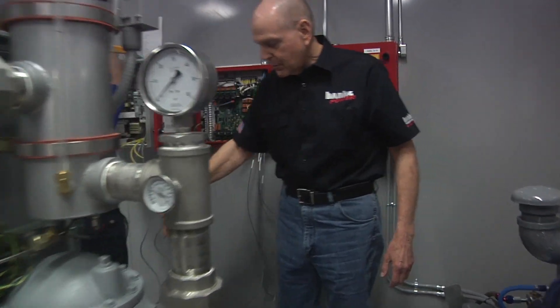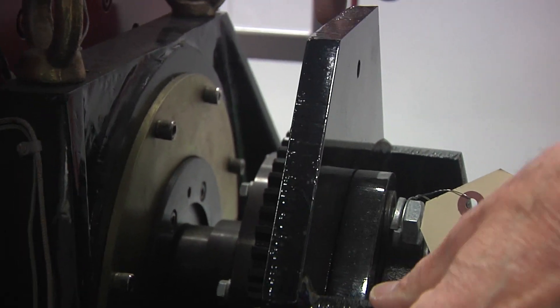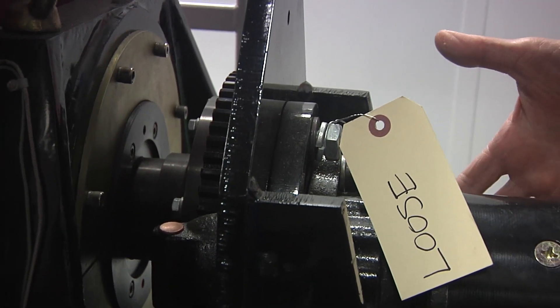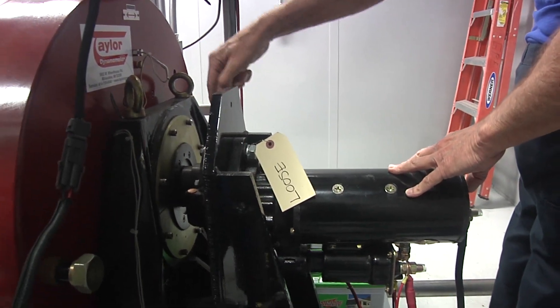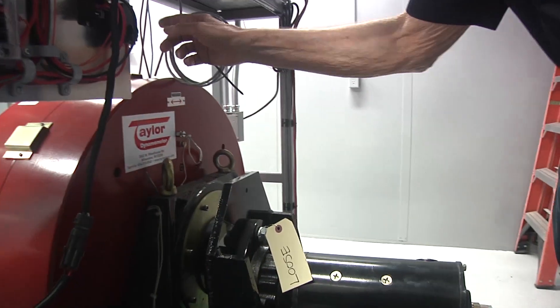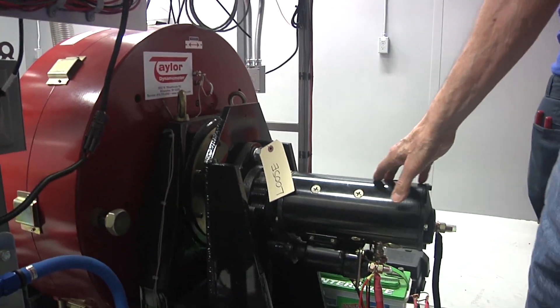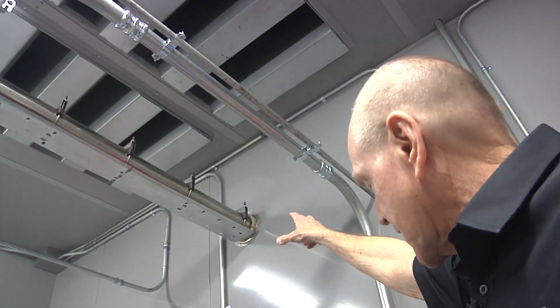The starter here is kind of serious — we don't have a ring gear, we just have this big spur gear driven by the pinion on the starter. What it does is spin up the dyno; the shaft goes through the dyno, the drive shaft turns the engine and fires it. So this is the starter for the engine right here. The exhaust is overhead — it goes up and out through the wall through this insulated opening.